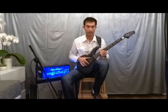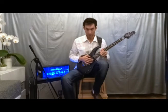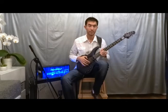Originally, this guitar has in the bridge position humbucker sound, in the middle position two humbuckers, and in the neck position neck humbucker sound. By using the push-push potentiometer, you can also get custom middle settings, two coils, two and three in parallel.